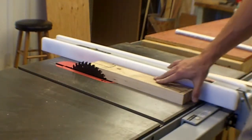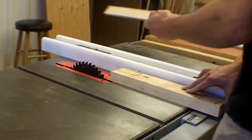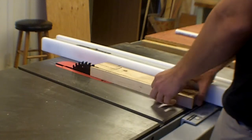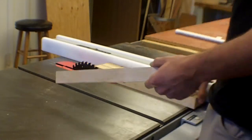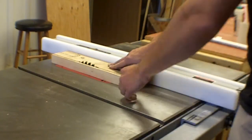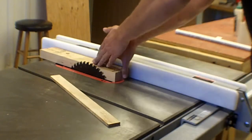That's a real cut this thing will do all day. I was holding it with my right hand pushing, thumb around the end of the work piece, and my left hand lightly holding it against the fence as it moved through. You encounter some resistive force as you push into the blade because it's actually cutting wood away. As I got towards the blade, I moved that hand away — there's not a whole lot of material there and I would have cut my thumb off. I used just one hand to push through with fingers away from the blade.